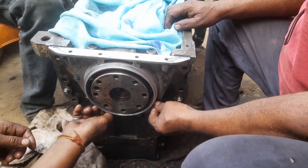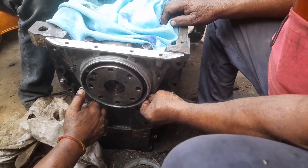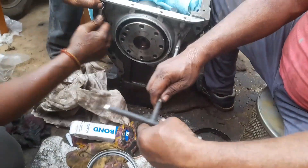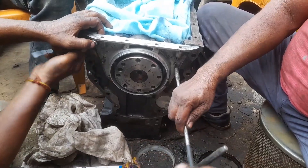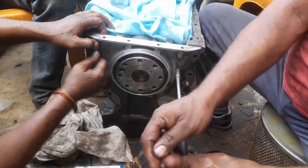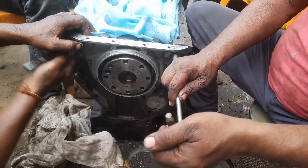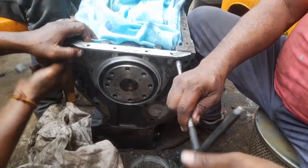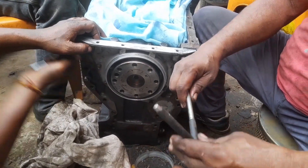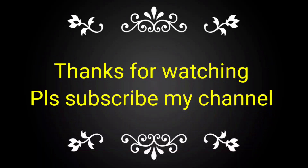When the excess gasket is on the surface of the RC plate as well as the cylinder block, we cut the excess gasket from the RC plate. This is because when the oil chamber is fitted, there will be no clearance between the RC plate, cylinder block, and oil chamber, so lube oil will never leak from this side. This is the process for the fitment of the RC plate.